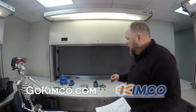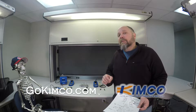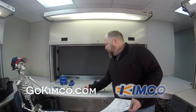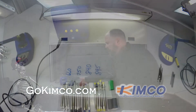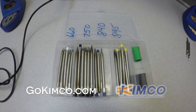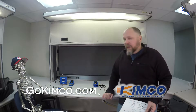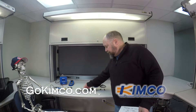As far as set point temperatures, you actually do not dial it in — the set point temperature is determined by the tip itself. For example, with the standard soldering unit, the white tips are 660 degrees, the black would be 750, the blue would be 840, and the yellow would be 895. The tip determines the temperature, and you can see how those are color-coded.